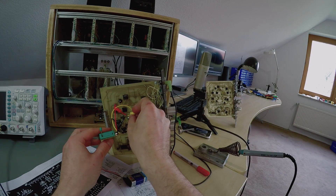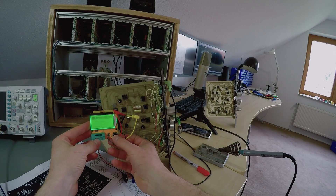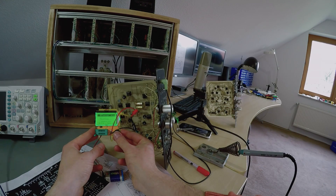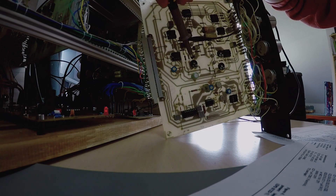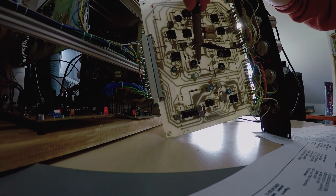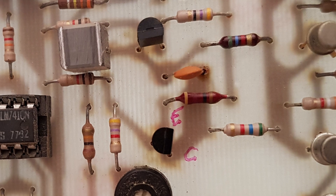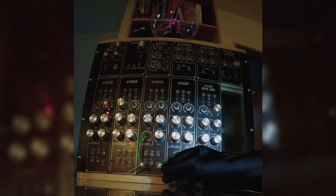Starting with the usual suspects, I hooked up a component tester to one of the transistors. The other one maybe? Nope. I poked around some more and found circumstances ideal, so I had to take a shot in the dark and replaced the transistors anyway, and that foil capacitor — because it seemed to have something like a polarity designator, which bothered me — and that did it, believe it or not.